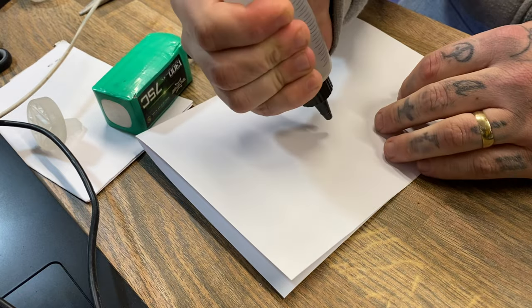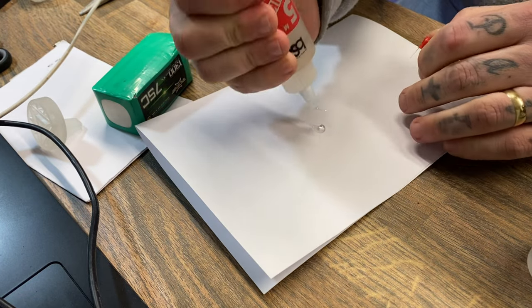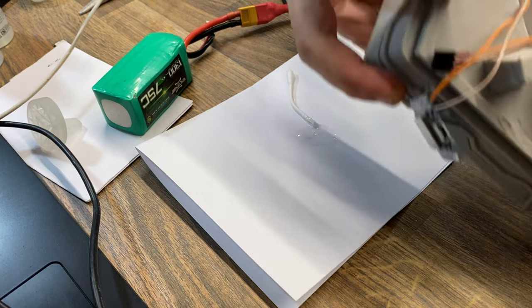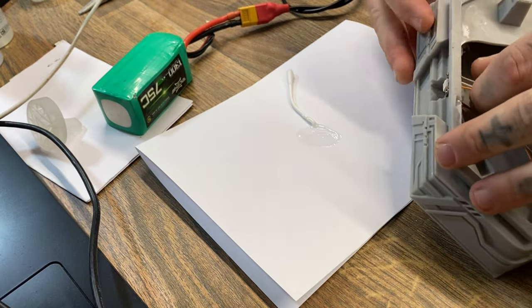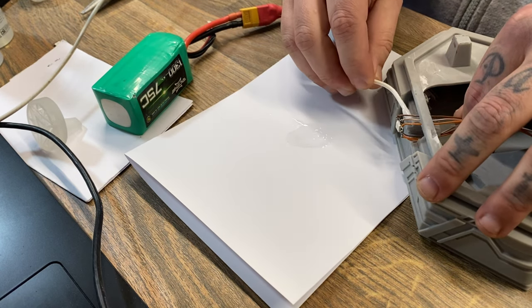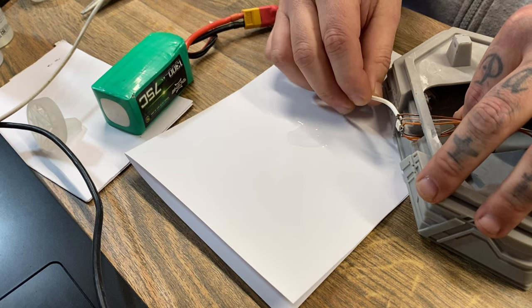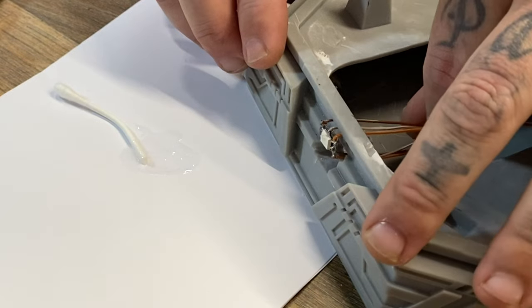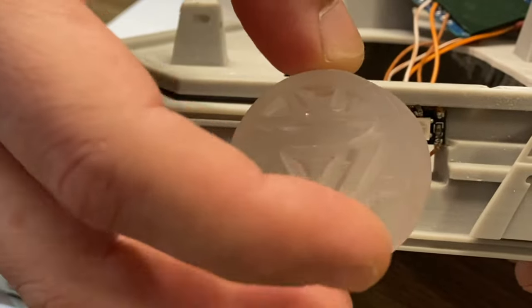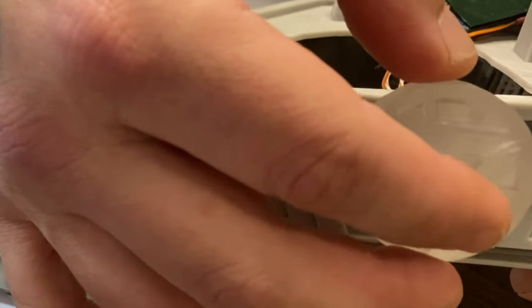Obviously, I needed to make sure that all the LEDs were glued in place, because you don't want them moving around when you move the model around and misaligning with the place you put them in the first place. For gluing the LEDs, the best thing I can suggest is to use something like a 5-minute epoxy. The reason I suggest this is because usually CA glues have fumes that come off of them, and this can sometimes hurt your components.